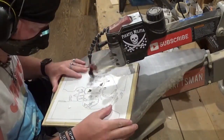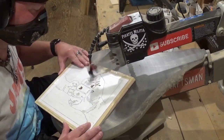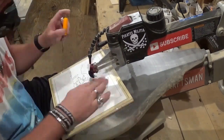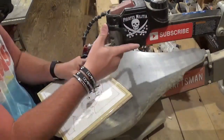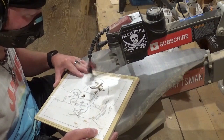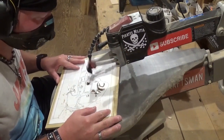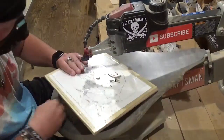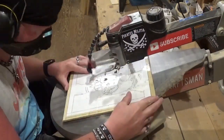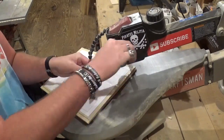I usually use number five blades and this is a number two blade, so it's a huge size difference and the blade is far more fragile — it can snap or pop very easily. You can see here that I'm not feeding into the blade; I'm just essentially guiding it through the material making sure all the cut lines flow. I hadn't done a spiral blade scroll saw project in a while and figured this would be an appropriate project for it, especially with Father's Day right around the corner. The last spiral blade portrait I did was the Santa Claus portrait from a few years ago.